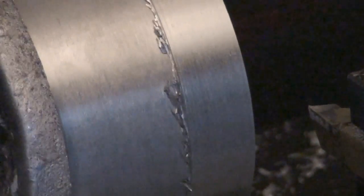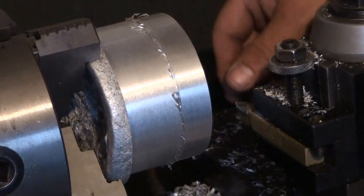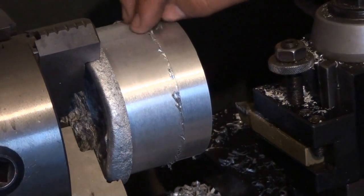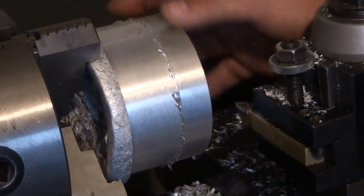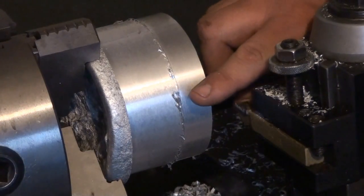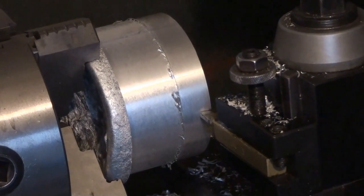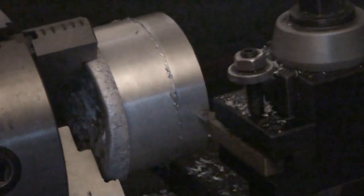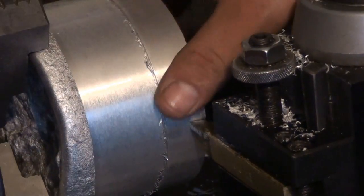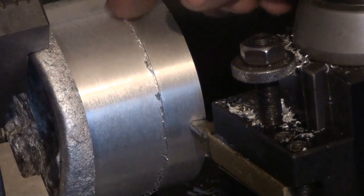It was getting too hot at that thickness — I should have taken maybe three or four thousandths. But you can see the difference: the 1550 RPM gives a much much better sheen to it. You can actually see the tool there. I'll finish cutting this and then flip it over and cut off all the excess on the other side.